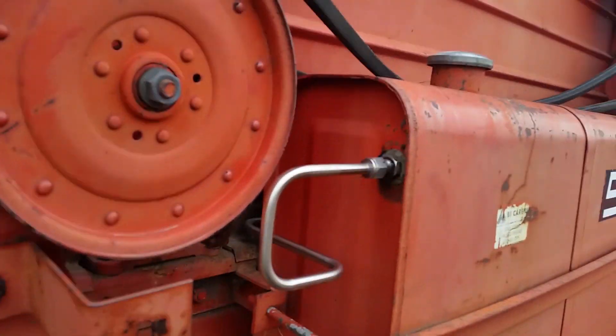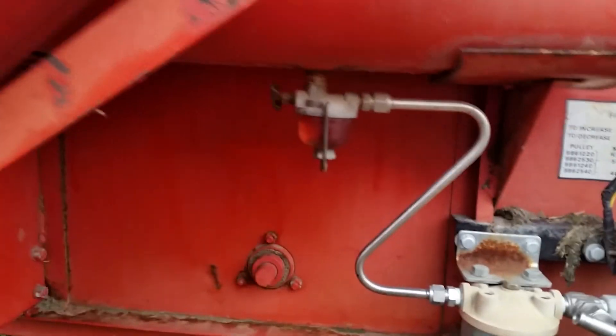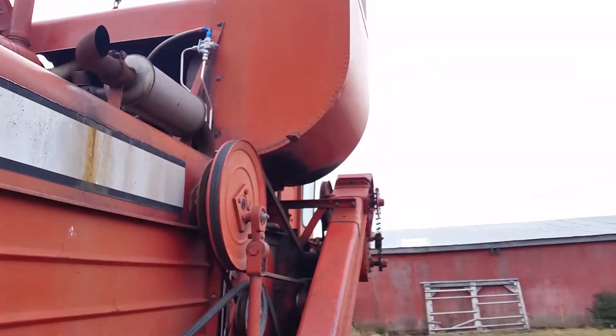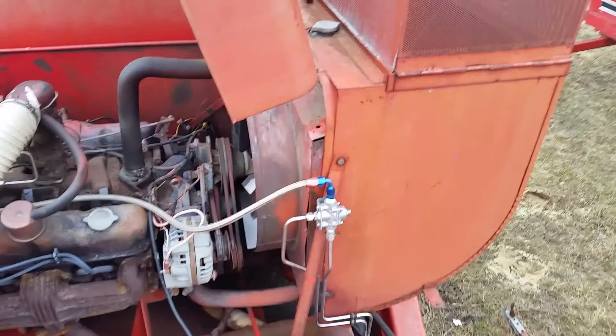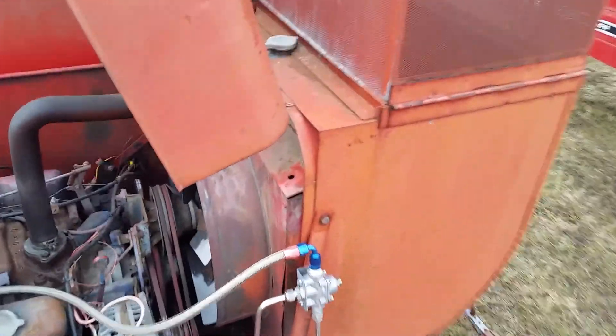This combine didn't use enough fuel, and the fuel pump actually heated up the fuel and would draw pressure, so I had to put this bypassing one in. I ended up running the return line back to the fuel tank. So when this pump's running, the float bowl's more like a flow indicator, because it's just a tornado of fuel in there. The pressure comes up at the bottom, recycles out the side, fuel to the motor at the top.